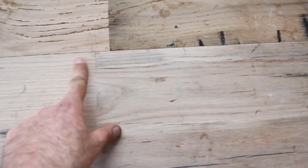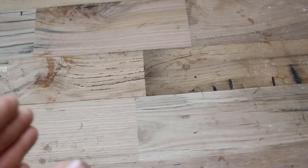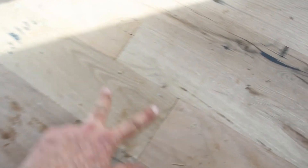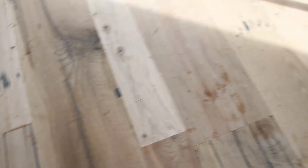Here's something else to avoid if you can: see these two joints? Structurally it doesn't really matter much because this is a glue-down product, but aesthetically it would be nice not to have these two wear layer seams so close together. Watch for that as you do the install — ideally they would be spaced something like this far apart. When the floor is down, you can't really tell where the wear layer splice is versus where the board truly starts and stops.